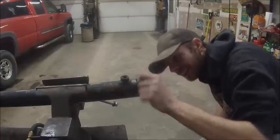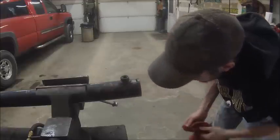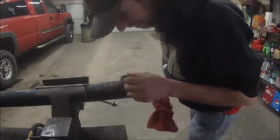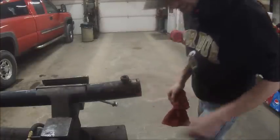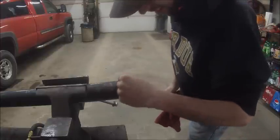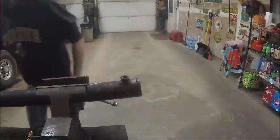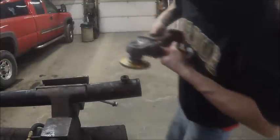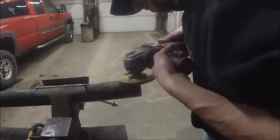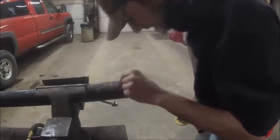That's not bad at all. And you gotta find a happy medium because you don't want to start taking too much meat out, because then that messes up the bore of your cylinder, and then that messes up how the seals work. And they doinked the bung on the end of the cylinder where the fitting goes onto the cylinder too. Well, they actually ovaled it a little bit.